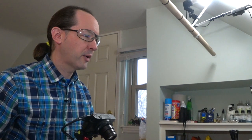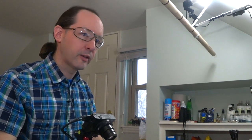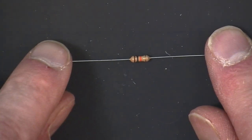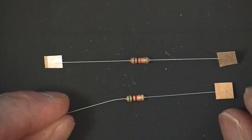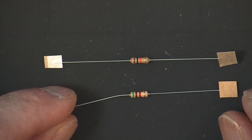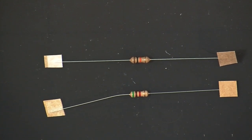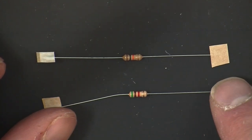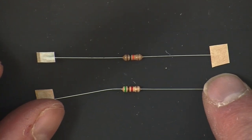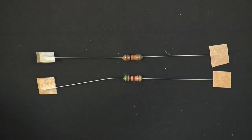All right, so we had an answer on our resistor color code. Looks like brown, black, red is 10K. Other should be 5K. So that's brown, black, orange, not brown, black, red. And then we've got green, black, red. So that's our color code we're trying to figure out. Can anybody take a shot at it? We've got two unidentified resistors. Brown, black, orange with a gold tolerance, and green, brown, red with a gold tolerance.